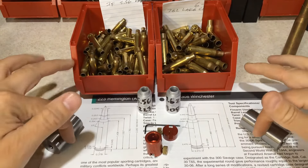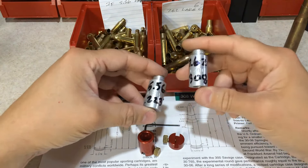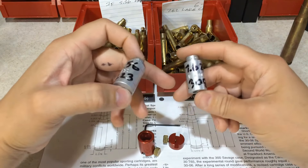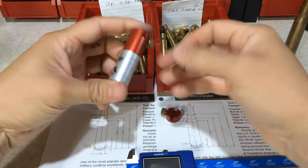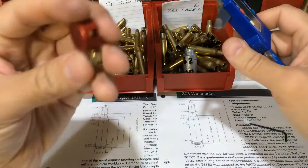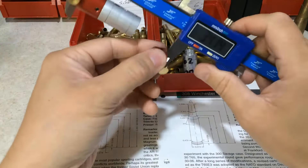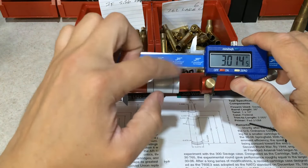So with that out of the way, this is what I like to use: a Hornady bump gauge, also a headspace gauge that you clamp on your calipers. For the 5.56 or .223, it's the A330; the 7.62 or .308, it's the D400. I can't stress the importance of using an anvil and also the importance of why you should use a decapping die, especially for cratered primers. Decapping your brass like we did in part one — this is the reason why. We'll get an accurate reading.